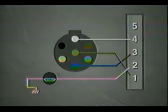To make the ABS warning lamp blink fault codes, apply power to the ECU through the stoplight circuit. This is the red wire from the 7-way connector. Then, apply power to the permanent power or blue wire circuit for 1 second. Remove power for 1 second, then reapply power. If a tractor is connected, this can be done through the ignition switch. The warning lamp will now blink the fault codes.